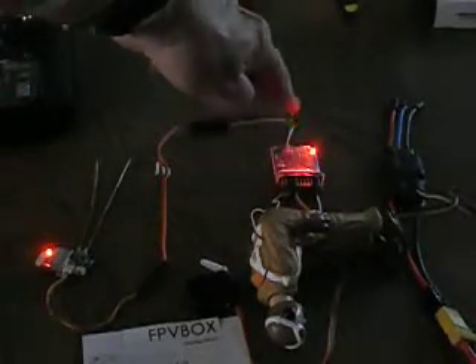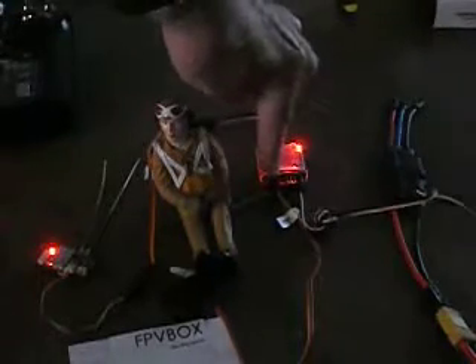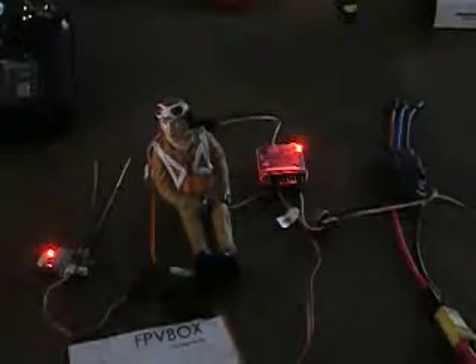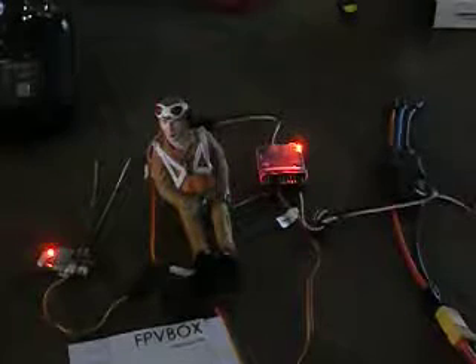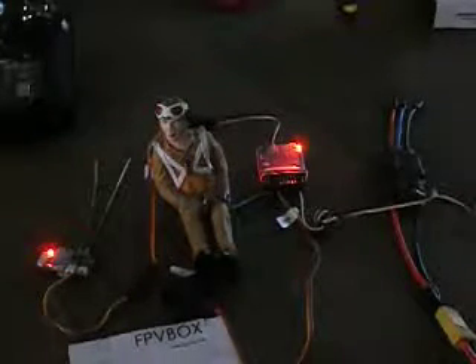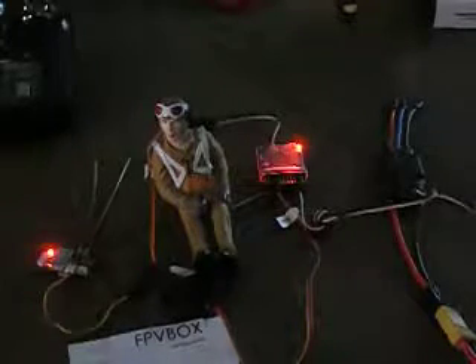Plug it into the wire that comes connected to the converter. Then you connect your ESC power wire to the number 3 slot on the converter, and that then powers the receiver through the power you're putting into the converter. This concludes the demonstration that with the 6-channel receiver, your FlySky radio, its IBUS output upgraded to 10 channels, you can get 10 servo channels without using the big IA10B receiver.